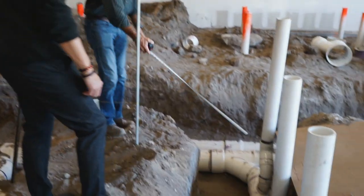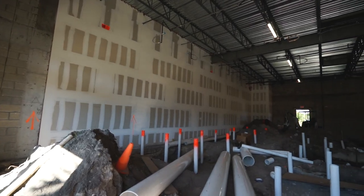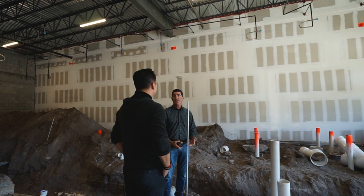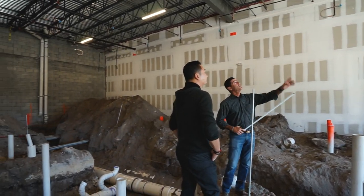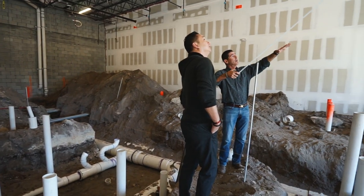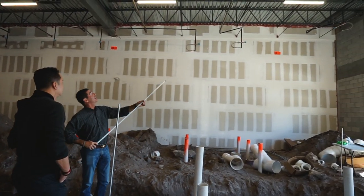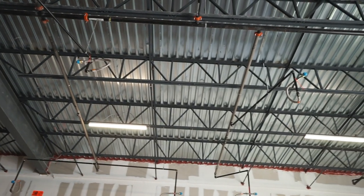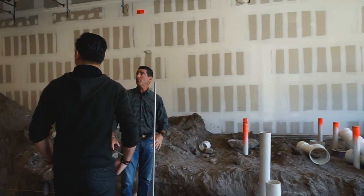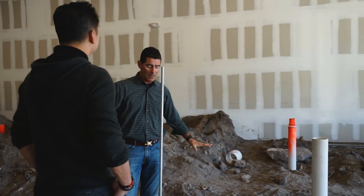So far, these guys have hit it perfectly. The ceiling height is fantastic here — it's single story, not multi-story. We've got twenty-two feet to the bottom of the joist, so there's plenty of room to do a fourteen-foot arch barrel ceiling, and fifteen feet out front. I got in here early and went ahead and put in my flex sprinklers, so that part of the work is done. Once the slab is poured, I'll come in and do the high work, give them a week or so, and then we'll start with framing.